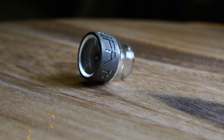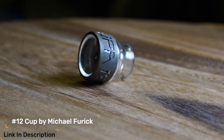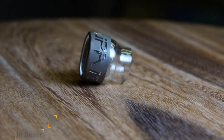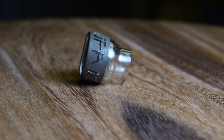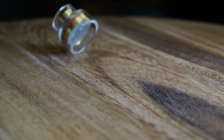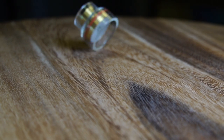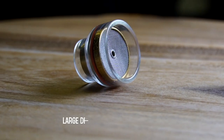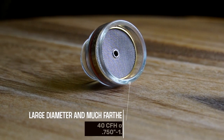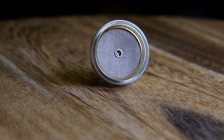In all its glory, this laboratory-grade creation has swept the welding community by storm and delivers even better gas coverage with its larger diameter and second diffuser that sits inside. This 'Batman Bajama' is made by my buddy Michael Furek, along with many other cups in his line. This brass and glass hybrid is my go-to for almost everything — a rainbow slant argon-munching machine. It gets the job done on steel, stainless steel, Inconel, and titanium without a problem. You can run a lot further with excellent gas coverage, with one and a quarter to one and a half inch long runs that have adequate gas coverage all the way around. This is my go-to cup on stainless steel tube and titanium.